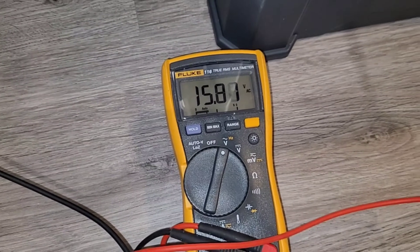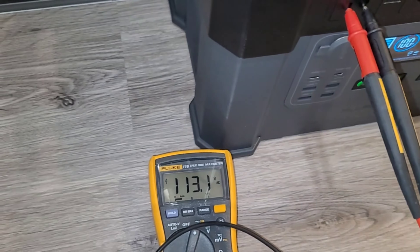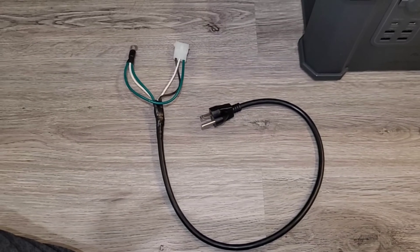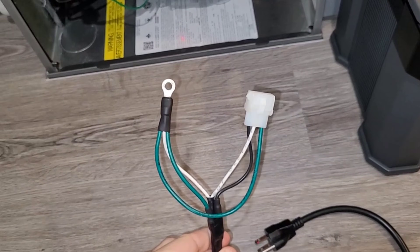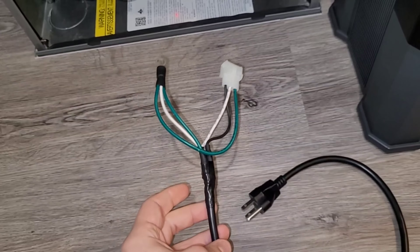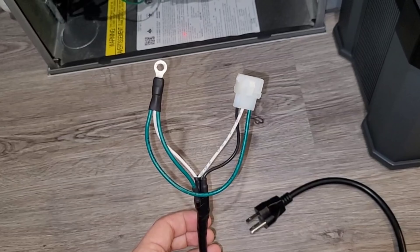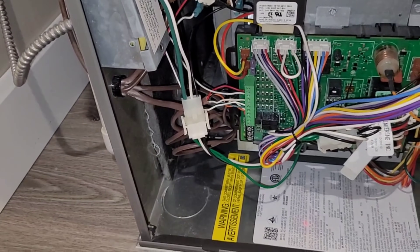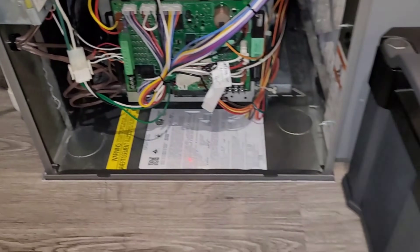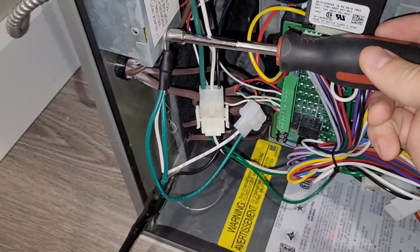That's our main problem for these furnace circuit boards — they're very sensitive to reverse polarity and they also need a good ground for flame rectification. There is something called a neutral-ground bonding plug you can buy for generators, and sometimes that will solve your issue. But today we're going to be making a plug that solves both of our issues: the floating neutral and the ground. I've gone hot-to-hot, neutral-to-neutral, and I've also tied the neutral into the ground, which solves both the voltage on the neutral and the ungrounded effect of the power station.